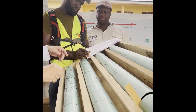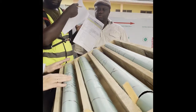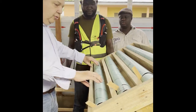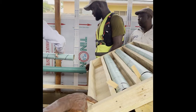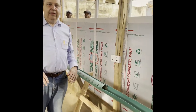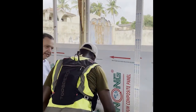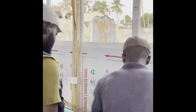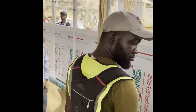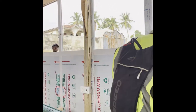The quick log will run from 0 to 50. We will do this in detail in a separate session. Once you have an idea of the limits, you take core by core very carefully and put it here on our core orientation tray. You just try to make it fit, because the core never breaks cleanly — it breaks irregularly — so you try to put it together.